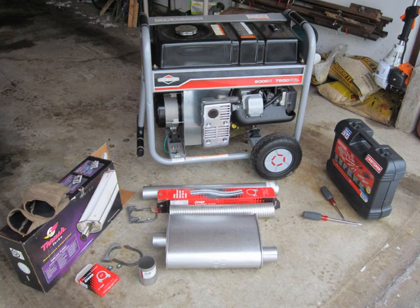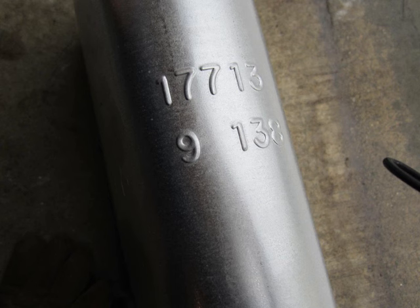My approach is to add a small automotive muffler in addition to the GEN-SET's small built-in muffler. A visit to the local auto parts store and a cost of about $65 provided me with all the necessary hardware. The first step was to decide on the muffler, and I chose a small one by Thrush. The store had the same muffler in two models that differed only in the diameter of the inlet and outlet fitting diameters, and I chose the one with the 2.5-inch fittings.